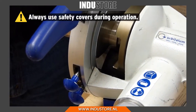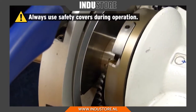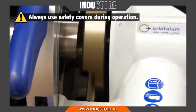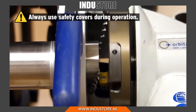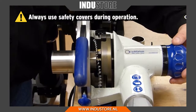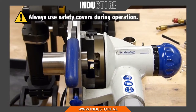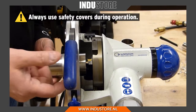You can see now it's pulling off the chip, removing material. All I have to do is keep feeding until it's got a continuous chip all the way around. Once it's done, I'll simply release the feed, let it continue one time around, then back the knob off and turn off the drill. At this point the machining is done.